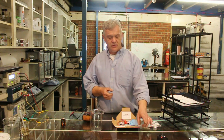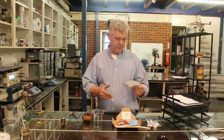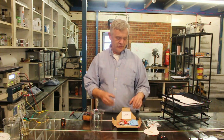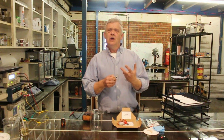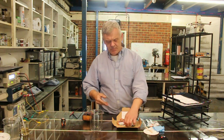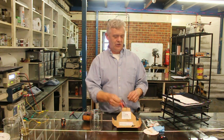Obviously you need a bit of equipment for that, so there's some filter paper. You're going to need to provide a filter funnel — we'll probably use a tea strainer or just fold the paper up. There's a stirrer for you to get everything mixed together, some scales so you can measure things, and a lovely bit of cellulose separator that we're going to use as the actual separator. There's a pair of gloves because although this stuff is non-toxic, it's pretty dirty, so always better to have your PPE ready. Then obviously you're going to need to test it — so we've given you a beautiful little electric motor. I use these all the time. Put a little propeller on it as an inductive load and it gives you a resistance that your battery's going to drive. We're also going to give you a little motor and propeller. Some people like to light things up — we're going to make a couple of batteries, so we've got a 3-volt forward LED. You can light up that LED, and there are a couple of crocodile clips so you can connect everything together.